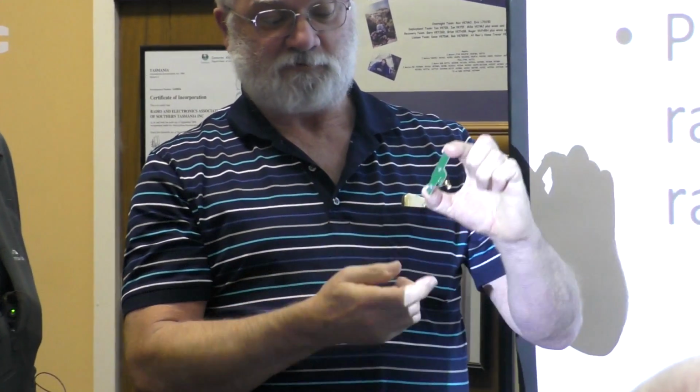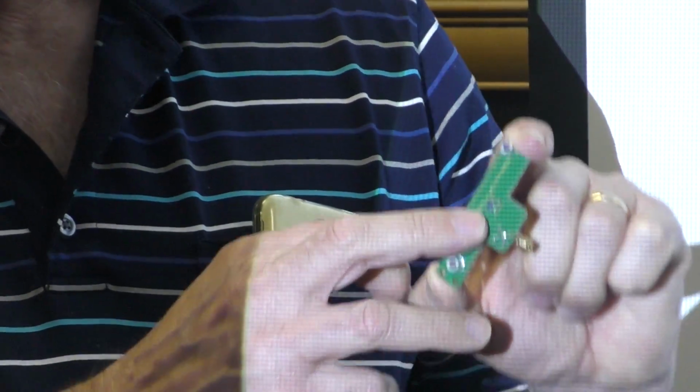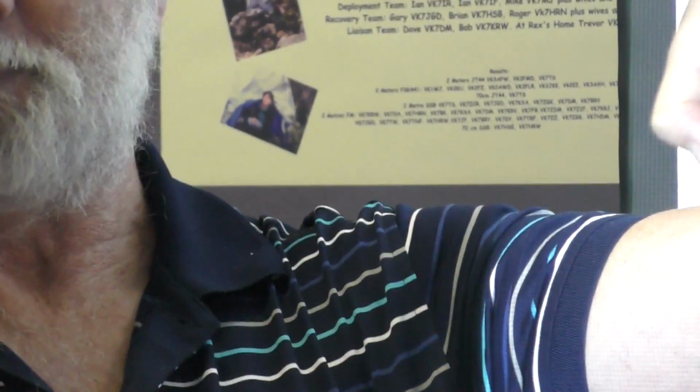This is the Leo Bodnar injection board, and all it's got is one SMA connector, which is where the signal goes in, 49.152 megahertz, and it's got a little inductor which just sits inside the can, and that's all it does. It just swamps its own oscillator with the signal that comes from the Leo Bodnar frequency source, which in this case is set for 49.152. This one's programmable from 400 Hz to 810 megahertz.